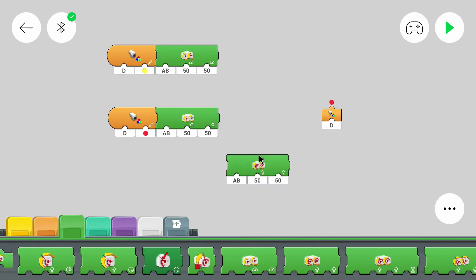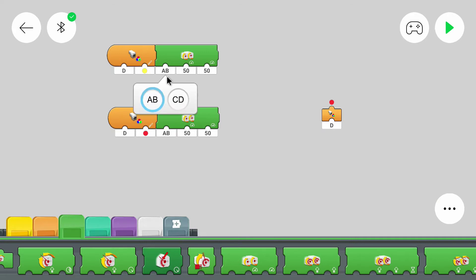This would be the same block for speed control if your motor supports it. You have to put the motors in ports that are related to each other - either one in port A and the other in port B, or one in port C and the other in port D. I will use A and B because for the Move hub from the Lego Boost sets it will also be A and B. The color and distance sensor is on port D and the color gets displayed here.